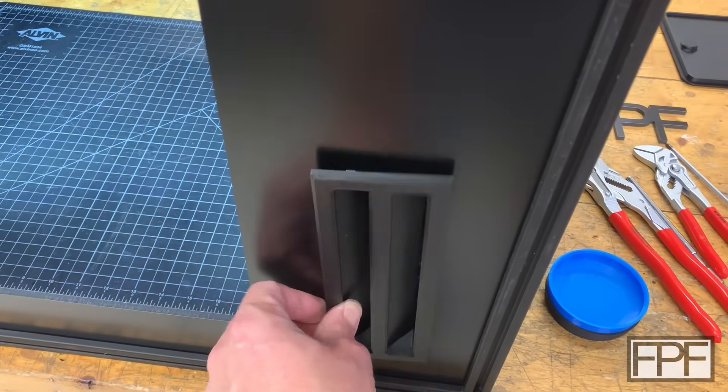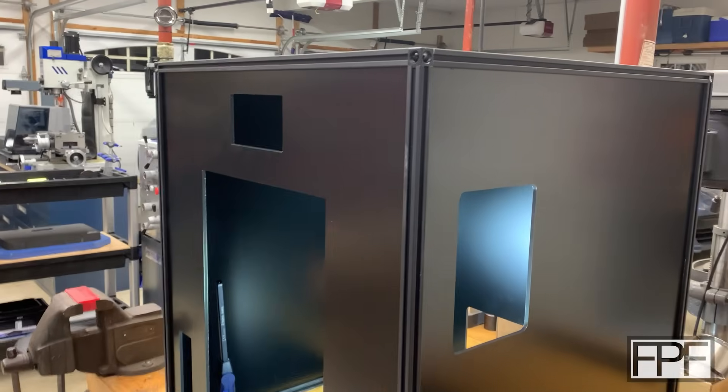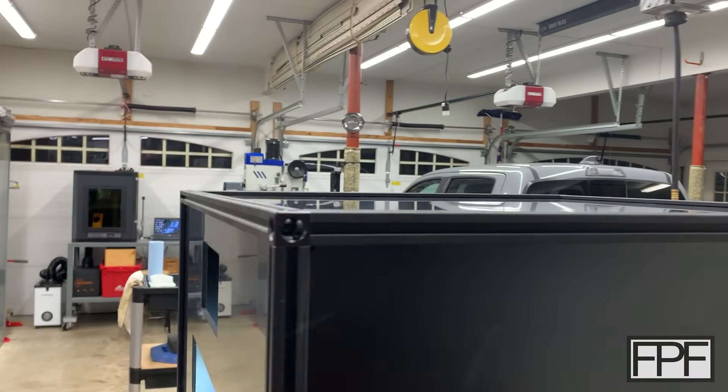These panels have a little bit of play — I can lift this panel up about two millimeters that I designed into it. Which means when it sits all the way down, we do have a very small gap at all the top corners, which I'm not a big fan of. I think what I might do is use a black silicone caulk — some of the smaller parts like these vents are just going to be secured with that anyway. Not only will that fill the gap, but it'll also keep these panels from shifting around as I move this. They can't come out of the tracks — they're captured in there — but they can flex a little bit. Once this guy's in place it won't be an issue, and if I ever disassemble this in the future, it won't be a big deal to just pull those out.